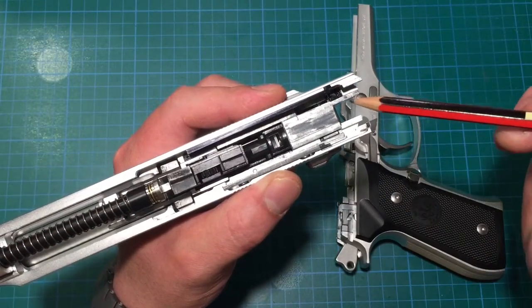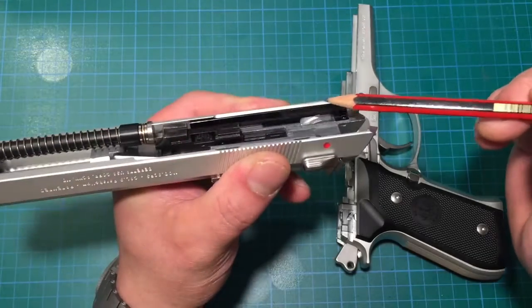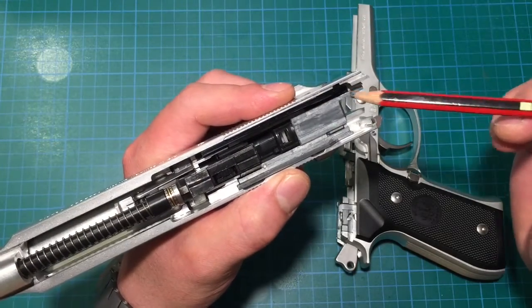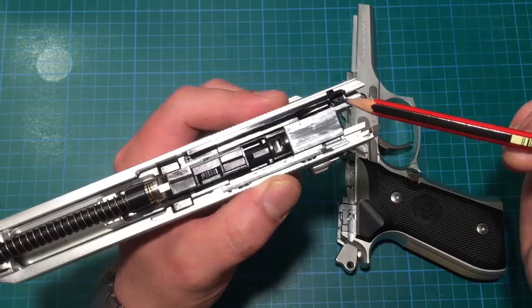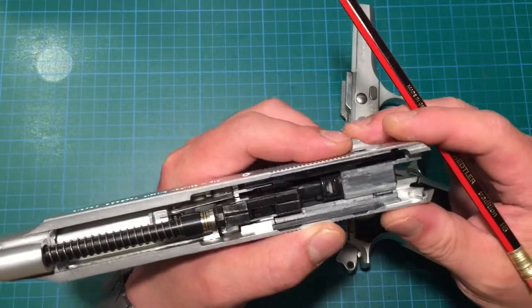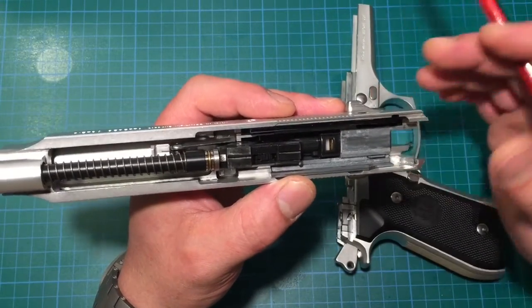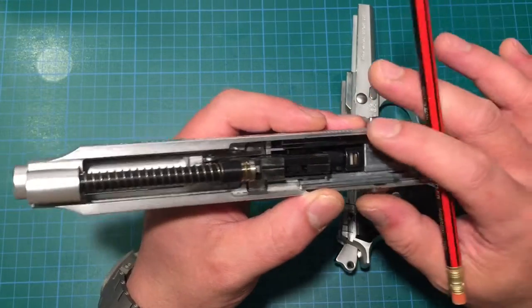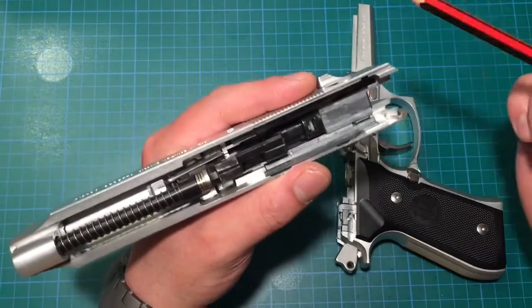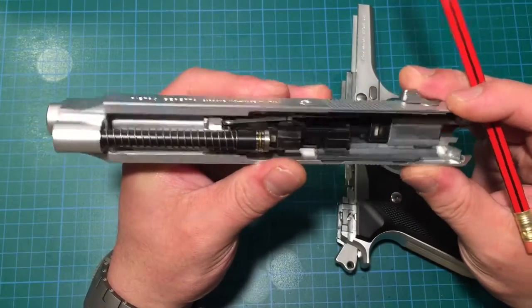As I was installing it quite harshly, trying to make sure I was getting this black bar piece here to bite down correctly, I was using too much stress, and I destroyed one of the small screws. We then noticed you have to install it very, very carefully, okay? Use the correct amount of force and don't overdo it. It just needs to be comfortably tight, nothing more, okay? So it's lucky that they thought of that and gave us a spare one. So we were very careful and we installed these 2 screws. That's the only note that we needed to make.